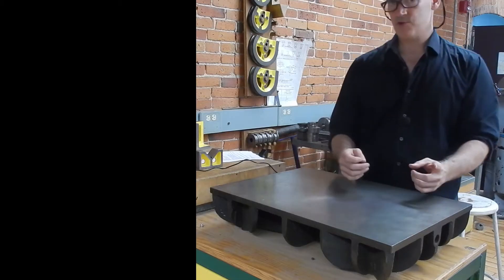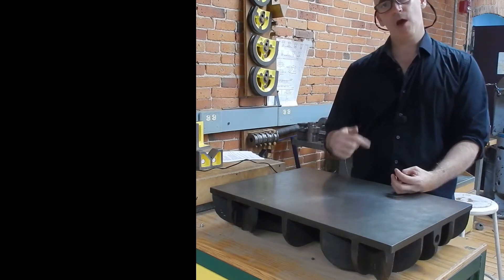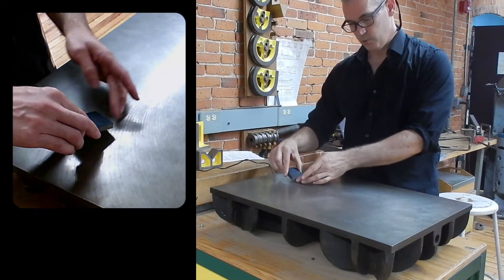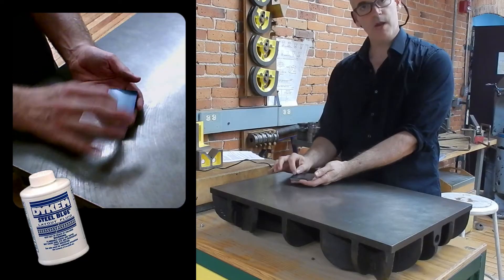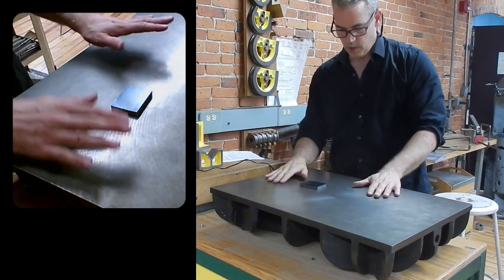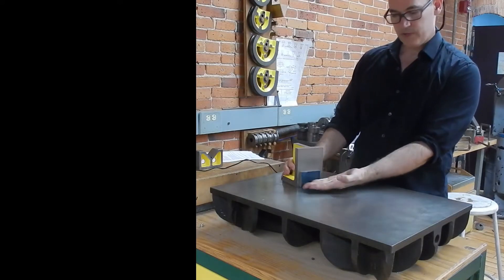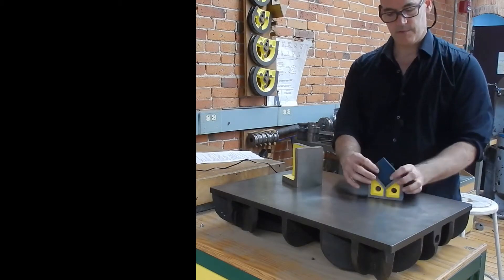My apologies to anyone who grew up using metric — this is not metric. You'll see why when we start to look at screws and threads, and a little bit when we look at the micrometer. I've taken the liberty of finding a piece of steel, filed the ends square, and removed all the burrs. If you have a burr on your metal, you won't be able to establish an accurate contact with your reference surface. I've put Dykem on the surface — a blue coating — so that when I scribe on here, you'll be able to see it better. On the surface plate, I can transfer very accurate measurements onto this piece of metal.